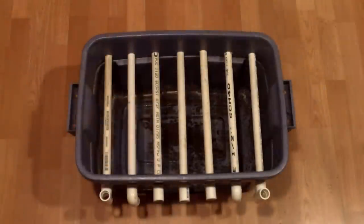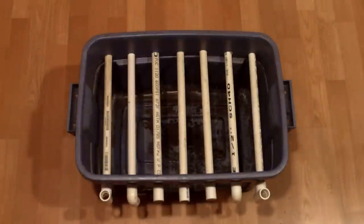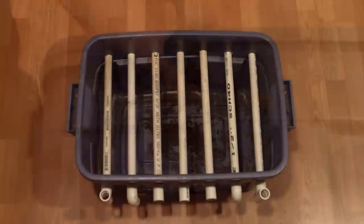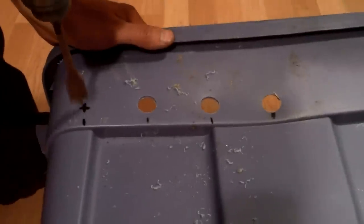Also, above this hole, seven half-inch PVC pipes run through the bin from front to back, forming a shelf upon which the top bin will rest. These holes are two and three-quarter inches apart on center, equidistant from the top, and were drilled with a thirteen-sixteenth-inch flat bit for a very snug fit. The PVC pipes were cut to length with a hacksaw.